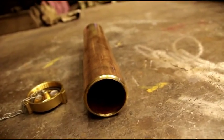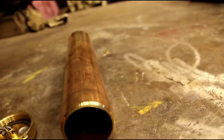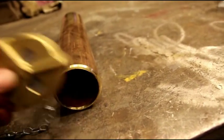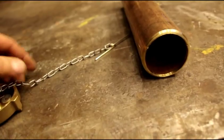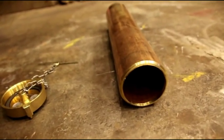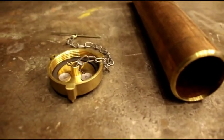I'll show you the dies we use to make the straight threads. It's also got to get an angle cut on it so it comes through the body in the right way. We'll put it in the pipe threader and get it threaded first while we've got something to hold on to, then get that cap screwed on. I need to figure out if we're going to use a chain or not — if we do, we'll change it to a brass chain. We don't want anything in there that's going to react or rust. We're making a copper tank so we never have to worry about that again.